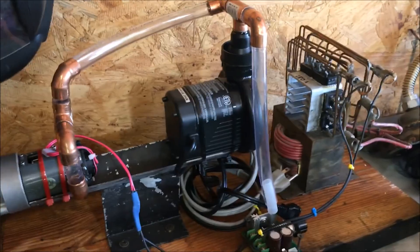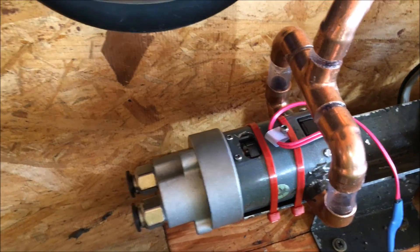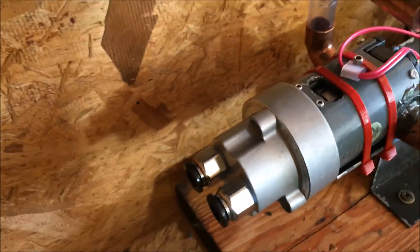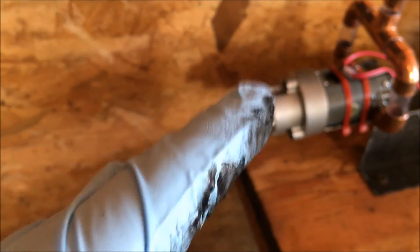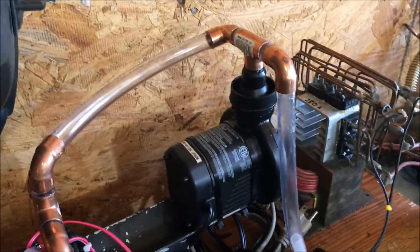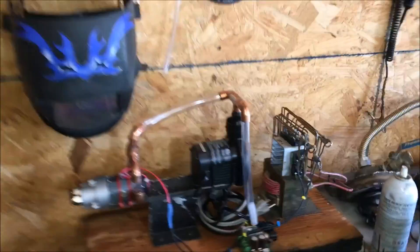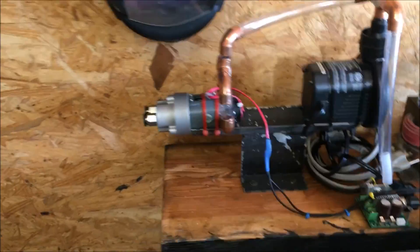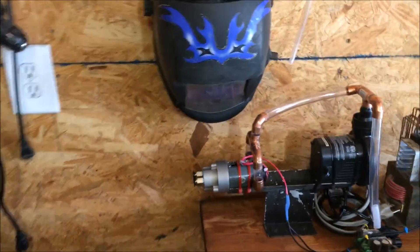In case you didn't see the other videos, this is the pump setup I had to use to run this thing. I know it looks a little elaborate, but this pump was incompatible with the job — its flow rate was just too high. So I had to run it at very low speeds. That is a G-rotor pump, so with low RPMs it's going to have a pulsating effect. I could feel the line kind of jumping with every pulse as if it was clogging up, and on the initial few hours of running it wasn't doing that. That's a fairly high-pressure pump — I'd say it can do over 100 PSI easily.